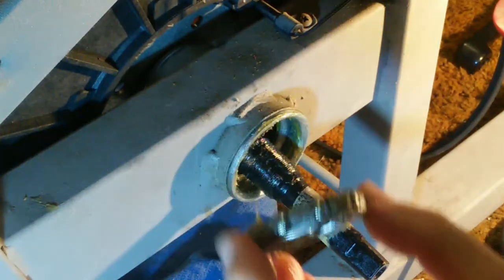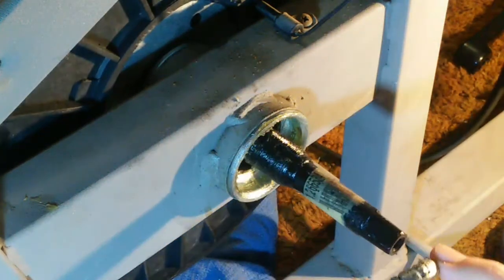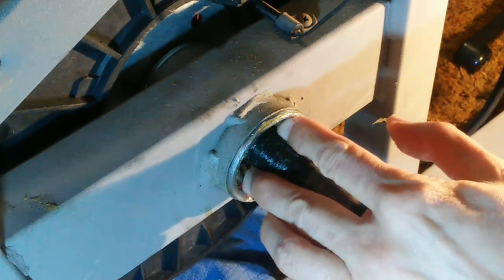I'm going to put this axle-pulley in through the left side bearing. Now we're going to put the bearings on the right side. We'll add a little more bearing grease and get it up inside the cages. Now we put this bearing on with the balls facing the outer bearing race.